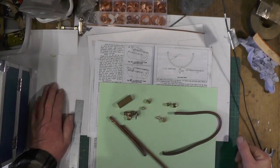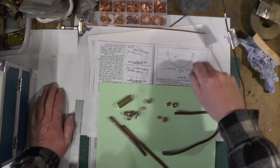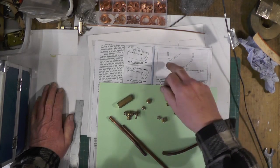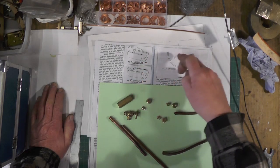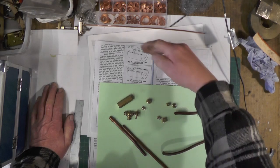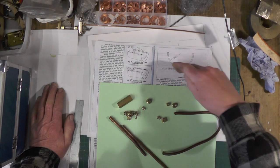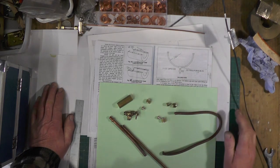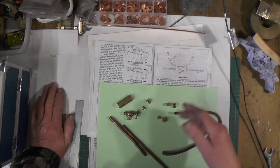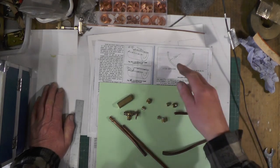Hey up everybody, I'm going to deal with the balance pipe today - my pipe work videos. This is the drawing for the balance pipe in the Sweet Pea book. Normally you put a saddle tank on, which makes the tank finish approximately on the center line of the boiler. That's why you put this arrangement onto the saddle tank. Because I'm doing pannier tanks, I'm going to do it differently.